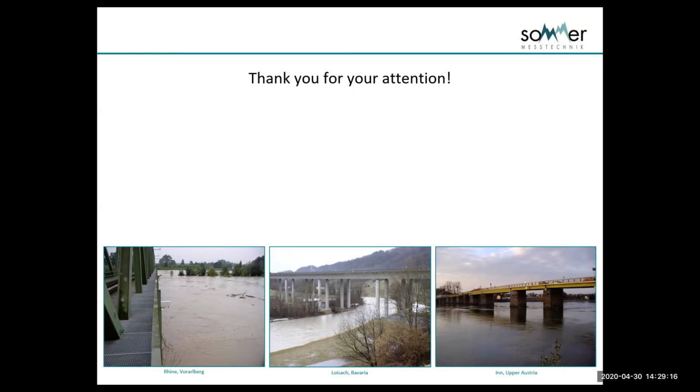If we don't have that, if the water is very glassy and we don't have much flow, we are not going to get a good measurement. So if somebody comes to me with a canal or a river and I look at some photos and it's moving incredibly slowly or is extremely glassy, straight away it's not going to be the instrument for that application. However, if the river or stream only gets like that at certain times, and most of the time it is flowing and we can measure, then that's okay, because we have features on the radar where we can set low-level borders below which we won't use the radar's measurement. We'll use the internal rating curve to extrapolate the very low measurements down to zero.